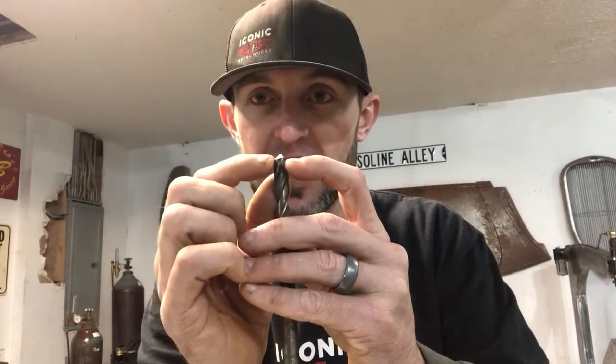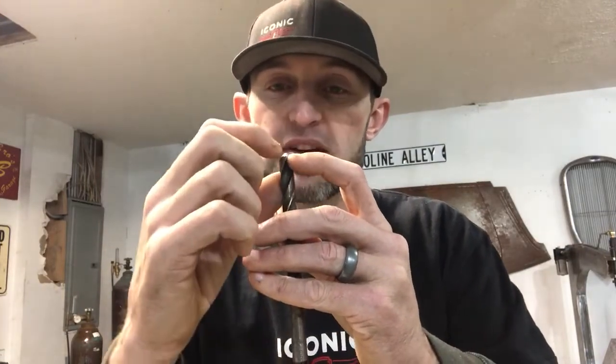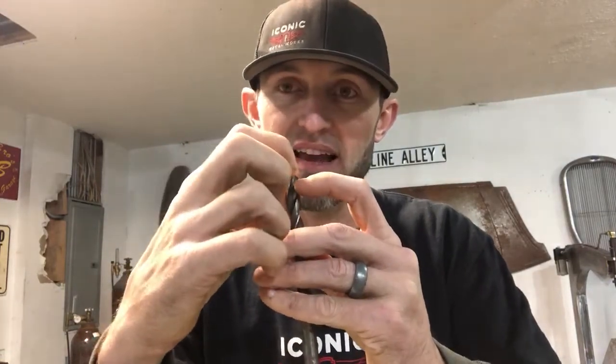But I guarantee you, I could do a drill bit right now that does not have any edge. If you look at most dull drill bits, the rear leading edge from your face will always be the same height as the cutting edge. That's why you're not cutting, you're not making chips.